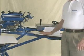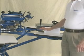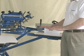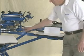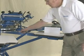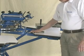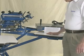You want all of these platens at exactly the same elevation and level. You don't want any pitch, because if there's a different pitch or elevation, that's going to change the off-contact when you're printing and it will change your registration. The way this press is built, we have a plate which is absolutely flat. The platen arm is bolted to that plate, so these arms are all exactly the same elevation, and the platens rest on that arm. The platens are all the same thickness, so they're all exactly the same.